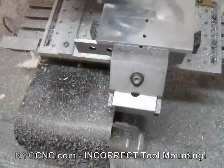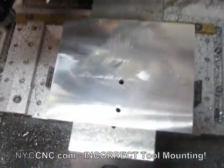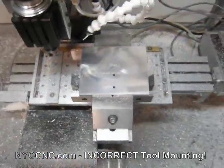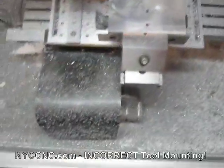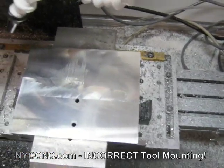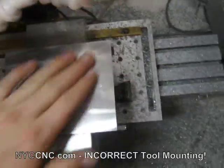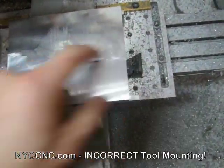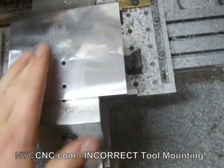I just finished the last pass on the fly cutting, and I'm going to take it out of the vise here and clean the part up a little, but I wanted to show you what it looks like — there's still some coolant residue on here. You'll notice I didn't actually finish fly cutting all the way down; there are probably a few tenths of a thousandth left that I left because I'm going to be sanding this anyway. I don't even need the surface this nice — it was simply an experiment. Really a great-looking surface, and the overlap in the two fly cutting passes is really nonexistent. Pretty happy with how it came out.